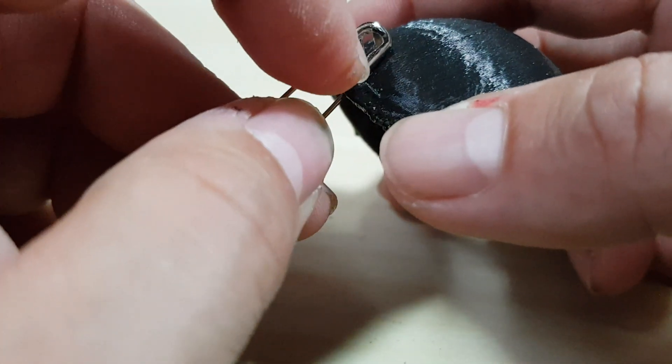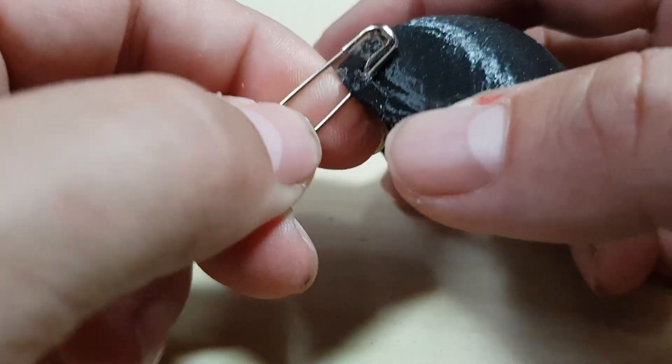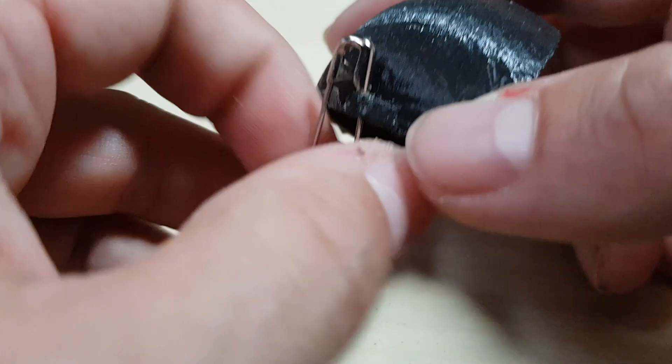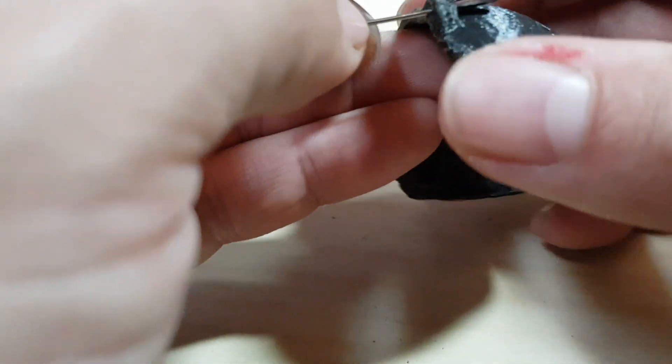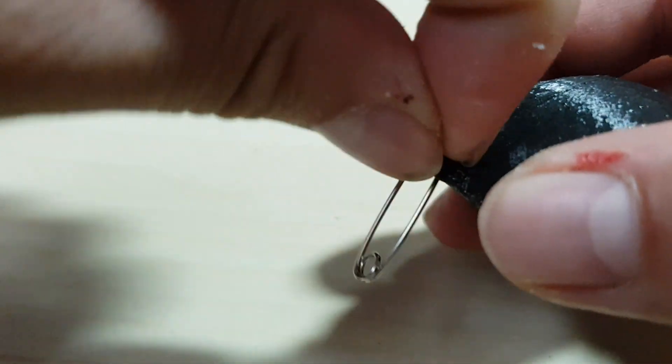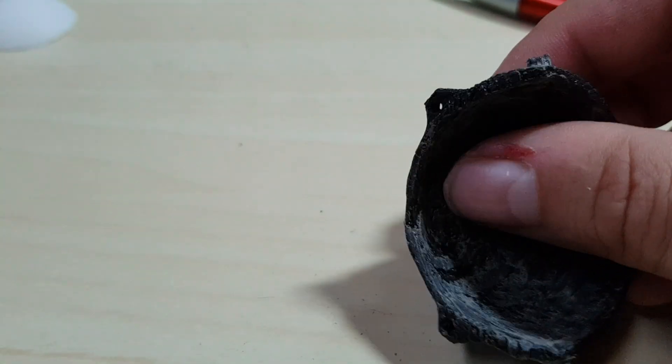If you just use a piece of metal and directly push, the pushing motion is not linear — it has to bend a little bit. So it works much better if you have a connection that can move a little bit upwards and downwards, or if you use something that can bend in itself, like the steel cable inside of a bicycle brake cable — a Bowden cable.